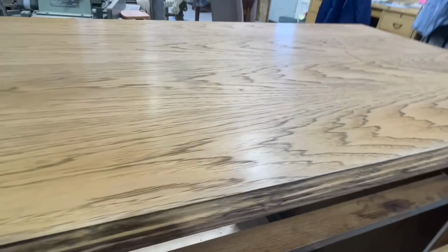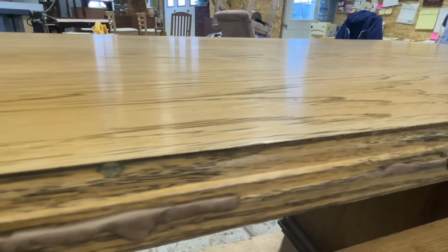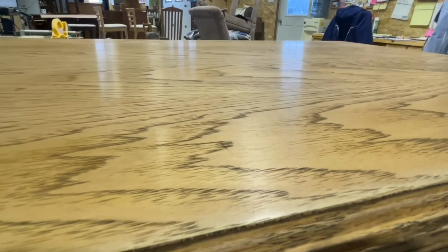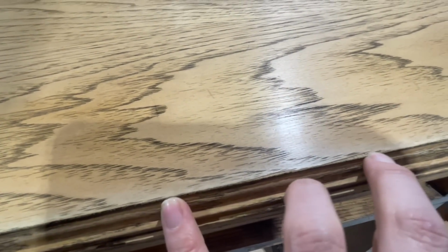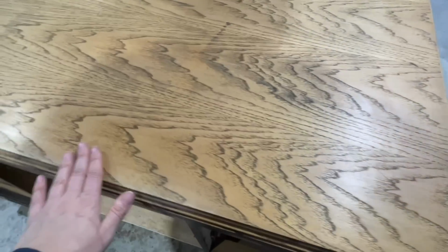And then we've got a bunch of edge damage. I've got some epoxy putty sitting in there that will shape back to the edge and get that all good. I still have a few more places to pop in. This front edge is really worn. You can see here there's some veneer that's just worn right off. It's very thin here, so sanding is going to be interesting. But I'm going to start with the 120 and see where we get.